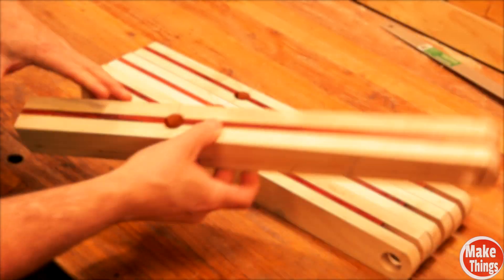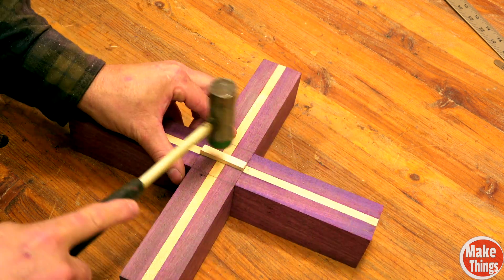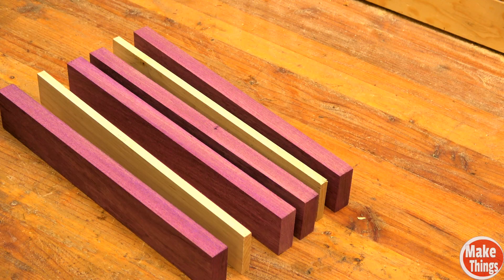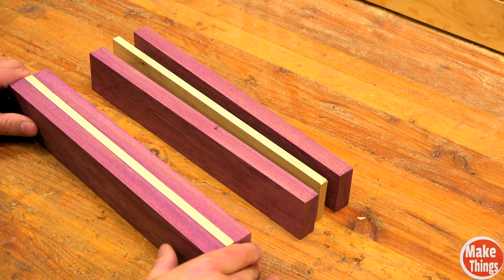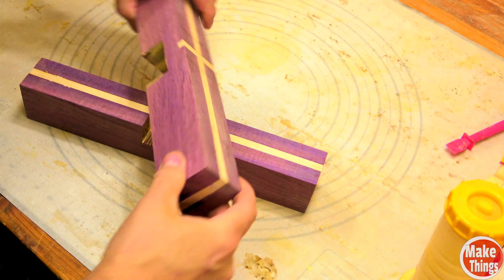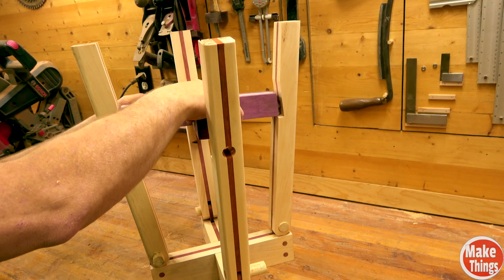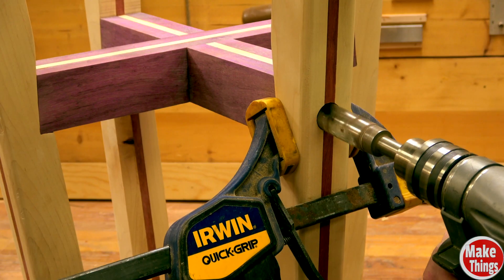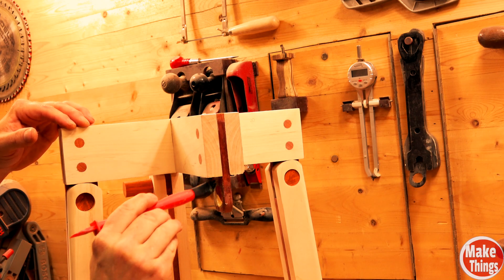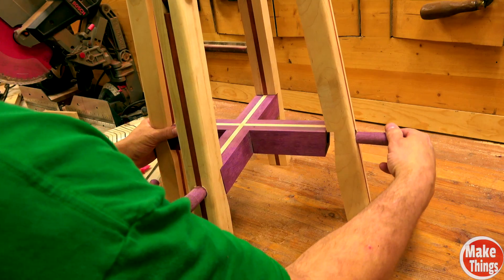Before I glue the legs to the hooks, I made a cross brace that fits in the center of the chair. The cross brace was made to emulate the three-part legs to give it a similar thickness — it could just as easily be made out of solid lumber. Like the base top, the centers of each arm will be cut and you'll again use a half lap joint to form your X. I clamped the brace to the legs before using the holes I drilled earlier as a template to drill into the base. Now it's easy to add glue to the hooks and dowels before pounding them in. We'll finish this off by adding dowels to the cross brace.